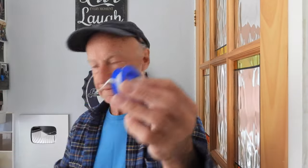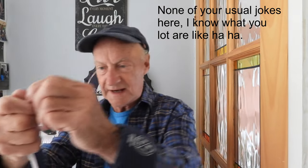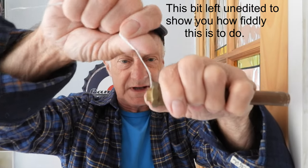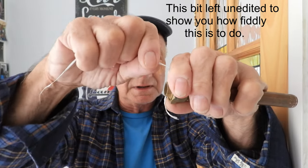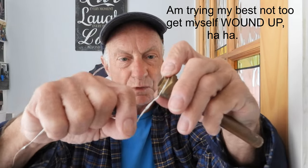Pull off about six inches or so of PTFE tape and twist it together, then wind that round the thread joint. I know it's a bit more awkward when it's in position under the cistern — it tends to want to come off. Dreadful stuff, but persevere and get it on. That's normally another fail-safe and usually does the job as well. A good alternative if you can't be bothered to get the proper fiber washer.